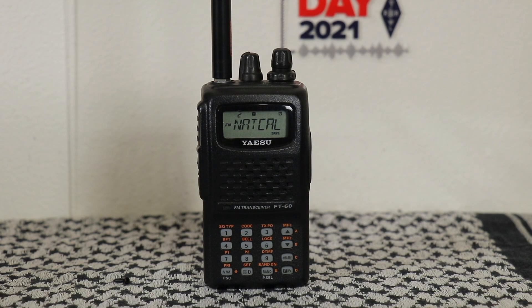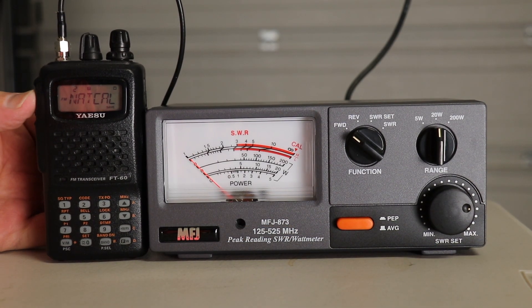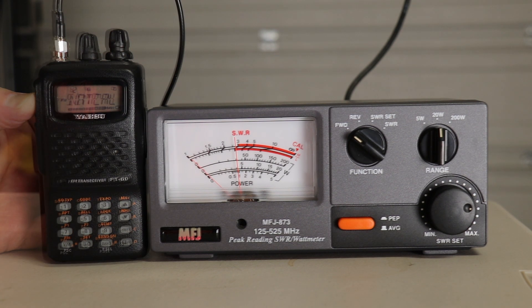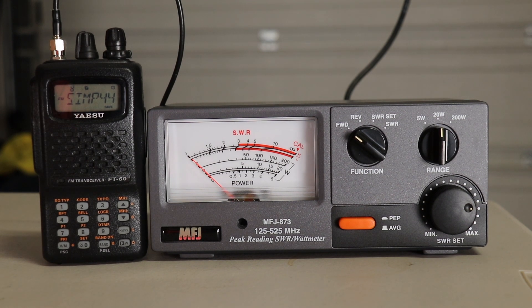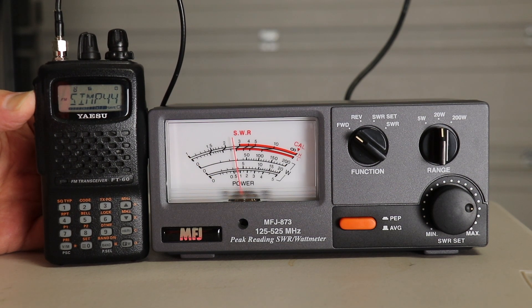This is the Yaesu FT-60 and is my first radio. It's a 2 meter/440 radio, does 5 watts, 1,000 memories, wide band receive. At the time of filming, it's going for $154.95 at Ham Radio Outlet. This is a tried and true radio — a real workhorse. Unfortunately, I've dropped it from a 6-foot shelving unit and it took the beating. On 2 meters, we're getting about 4.5 watts, and on the simplex 440 frequency, we're right at 4 watts.